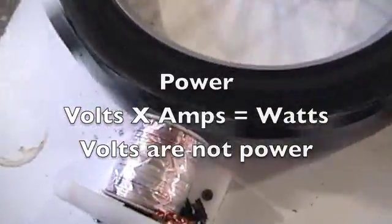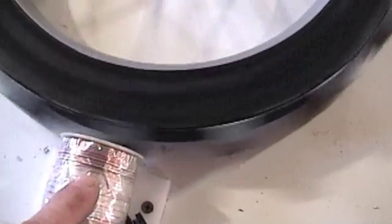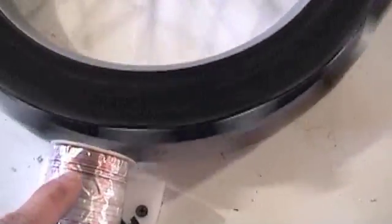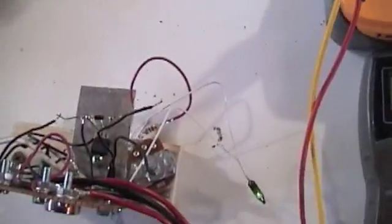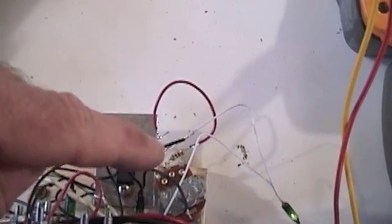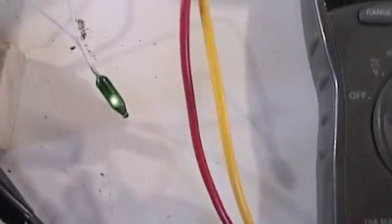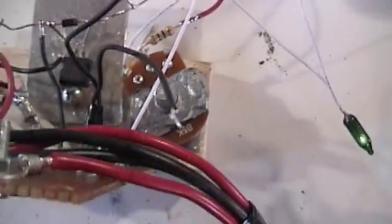On this setup, my coil is one ohm resistance on the drive coil, one and a half ohms on the trigger coil. It's wound 18 gauge and 20 gauge. Here on the resistance in the circuit, I have 115 ohms. I can replace this little bulb and this potentiometer with hardwired resistors — 115 ohms.